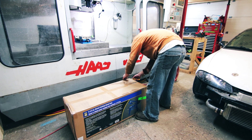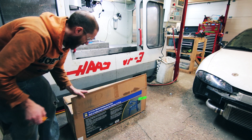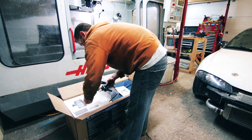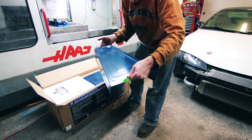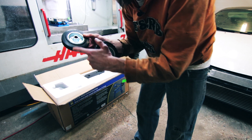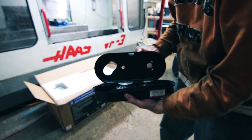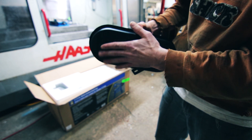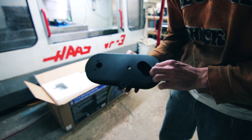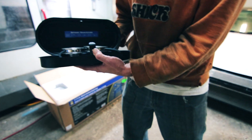Pretty excited — I've never had a bandsaw before. It's got that new saw smell. Beautiful finish. Look at the way this cardboard's really put a nice patina on it. They were right — they do actually have little needle bearings inside the wheel, that was a nice little bonus. So this one's going to need a little modification; the one in the store was rubbing on the edge of the pulley, so it's probably going to have to push it down a little bit more. And this hole right here needs to be opened up a little bit more because it did not allow the belt to be tensioned — but those are kind of minor things.